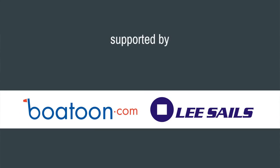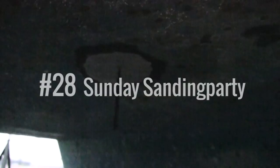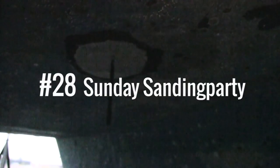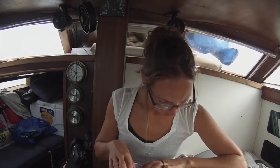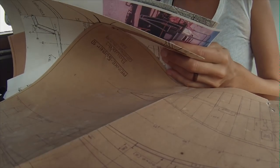There was a hole between the keels where first salt water was coming out and then a handful of diesel. I was worried it might go right into my tank. I looked at the plans and the bottom of the tank is actually the bottom of the boat. I checked the tank and there's about 30 liters of diesel in there, so it's very unlikely the hole is actually in my tank, which is good.